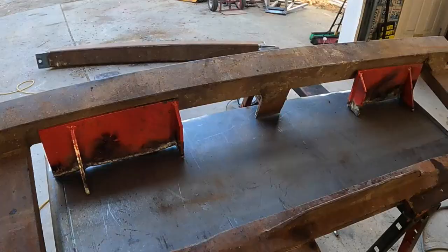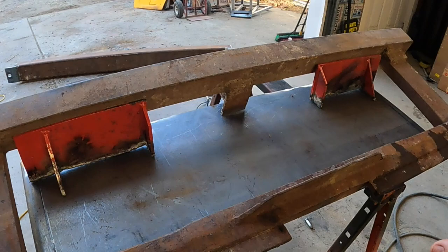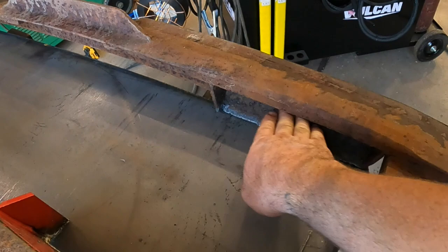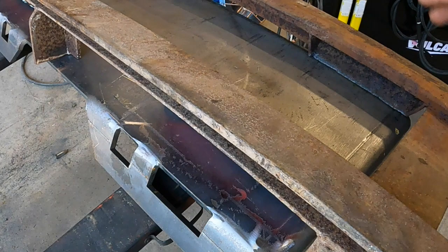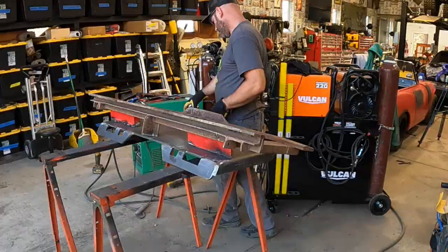If I were to just put this on there flat, I would never be able to tip my forks back, so that's why they have them angled out. I don't know what this originally was, but looking at these plates, I'm pretty sure this was a rack for a normal Bobcat and that's the old pocket. It measures out just about right, but the problem is I don't have any of the bottom stuff. I figured adding reinforcement would be better. This is a half-inch plate backstock — I just got that one shipped to my door for $169 from Amazon. There's a link in the description below.